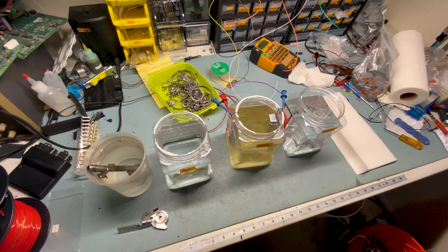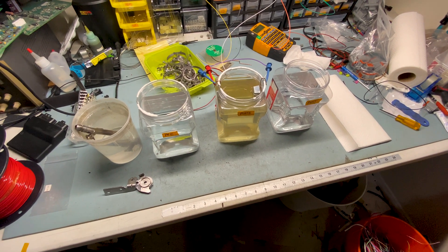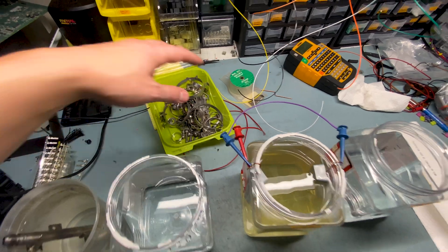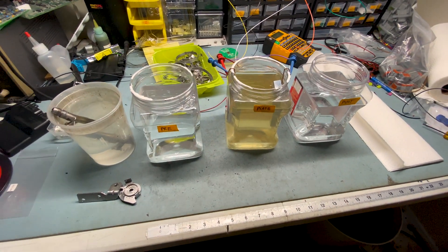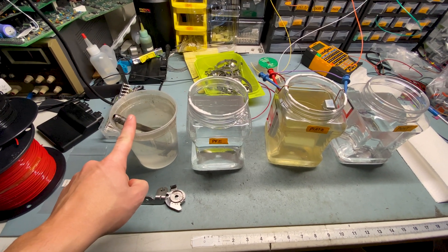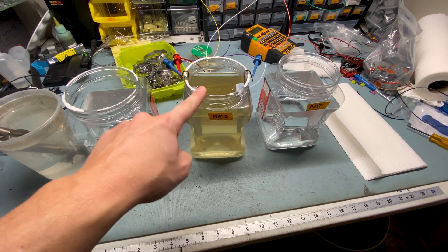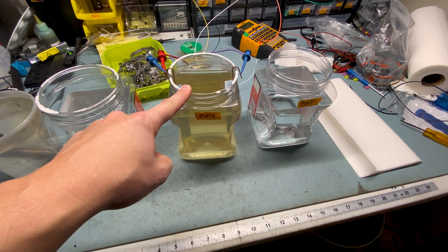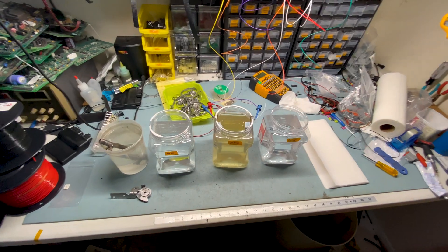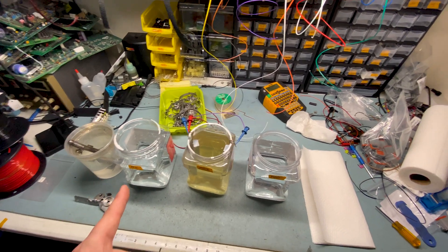This should be an interesting little experiment - you guys are coming along with me live for this one. I haven't actually tried this before, I've just followed along on some videos. We are going to zinc plate all of this hardware that I've been preparing. I'm not being excessively precious about this. This is just some vinegar to pre-prep it, some filtered water from a Brita pitcher, a plating solution - I'll put a link to the video I'm copying. And then just some tap water to clean things off afterwards. I'm in my wiring shop because I need my power supply to run this thing.